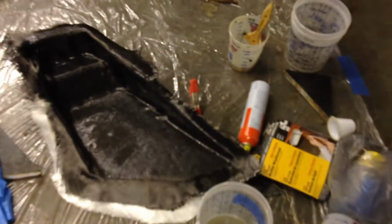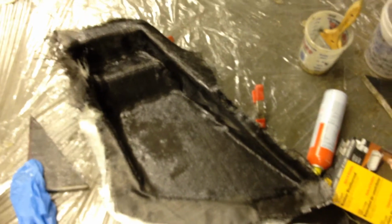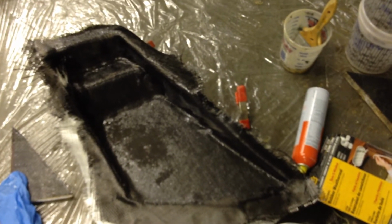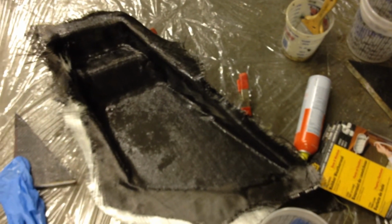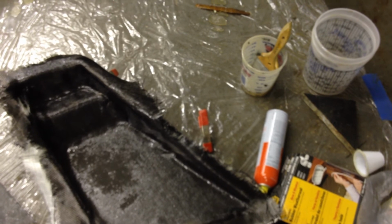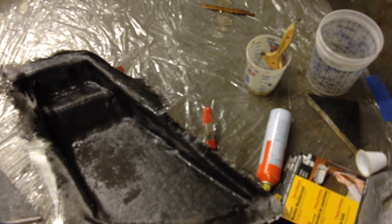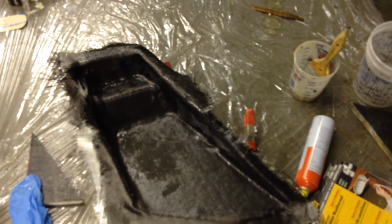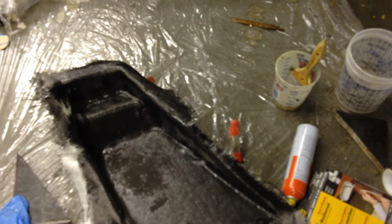Yeah. Awesome. And then here is the headlight mold that Milo has waxed, put Vaseline on together, making a release agent, and then wet it out. And that actually is looking much better, Milo. Because it had some wrinkles before because there wasn't quite enough epoxy. Now there is. And it looks like there could be even fewer wrinkles if the technique that you'd mentioned had been applied, where resin was put down first, which you said was passed on from Erica. Yeah. Resin, then the ply, and then resin, then the next ply, then resin, then the next ply.